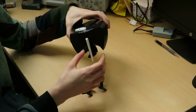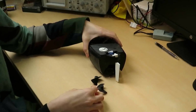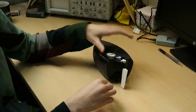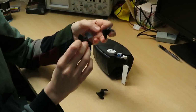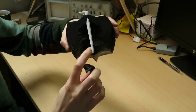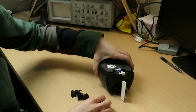We were discussing what kind of propeller we should install on Bruce II, and we decided to take this opportunity to run some experiments. So what we did was to print 4 different propellers, all different among themselves. We have 2 propellers with 3 blades, and 2 propellers with 2 blades, and they're also different in profiles. So these two have a straight profile, while this one and this one have more of a curve to the blade profile. And we were betting on this one to be the faster, but we'll see how it ends.